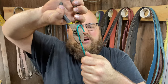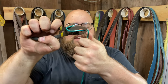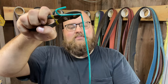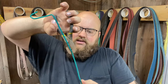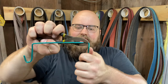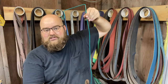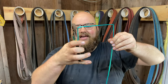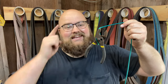Then pound it back so that it gives me a nice little hook to hang the basket on. After that I'll be going down four to six inches or so and give it a 90 degree bend, make sure everything is nice and straight. Then from there I'll be going about eight inches to a foot or so and give it another 90 degree bend — and there you have your shepherd's hook that'll work perfect for hanging baskets. So now let's go ahead and jump on over to the forge and get that steel hot.